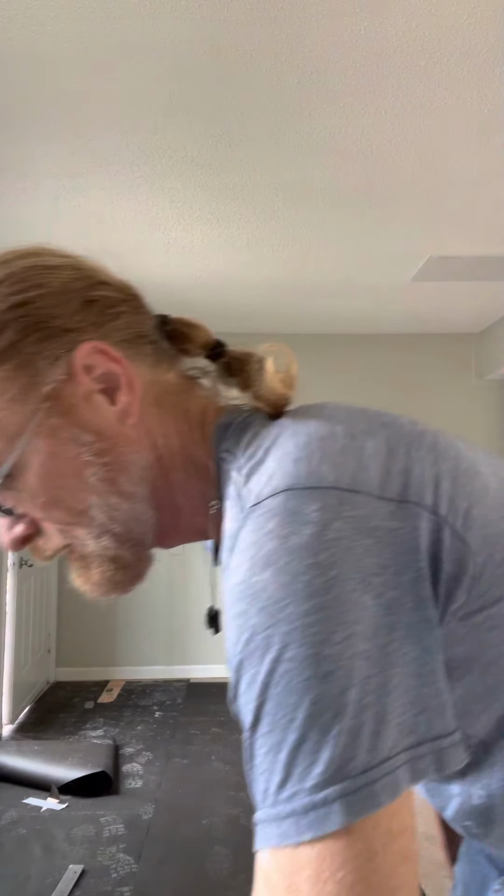Now what I'm gonna do here is I'm just gonna take it, and I'm gonna butt it up against that seam right there, really nice and neat, all the way down. I'm gonna pull this back down here, of course. I'm gonna cut it away from the wall, no greater than 2 inches. Actually, that looks great right there. But I'm gonna butt that seam, and I'm gonna come back and tape the seam. And I'm gonna relief cut this right here.